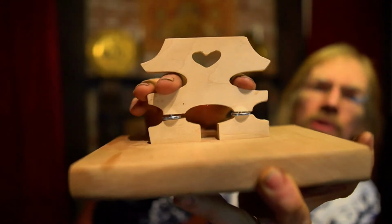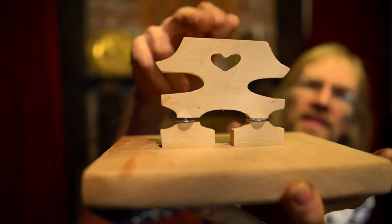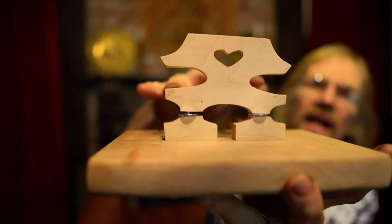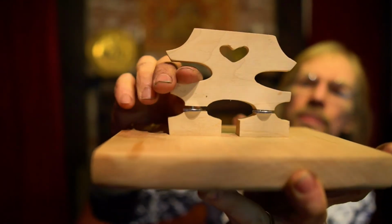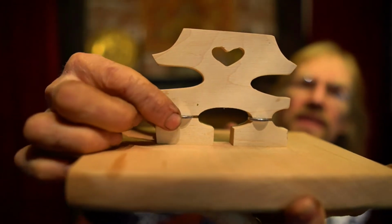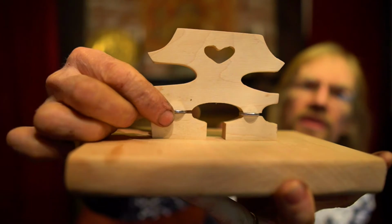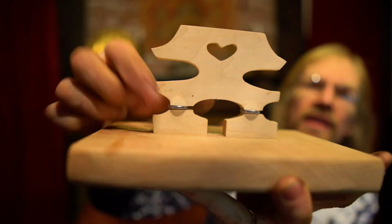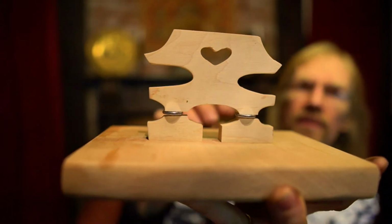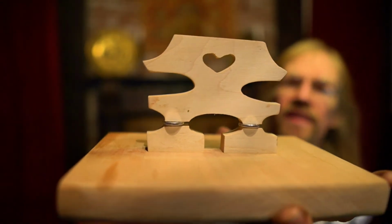Why do I mention that? Why is that important? Well, when you're adjusting the thumb wheels, keep in mind this top portion is resting on the mounting posts there. So you don't want it to get cockeyed sideways or else it could jam up and stop raising or lowering, which is kind of a hassle to sort out. When you're raising it, turn one thumb wheel a couple of turns and then the other one a couple of turns. A couple of turns here, a couple turns there. So you're not lifting one side way up and the other hardly at all. You're keeping them kind of even as you work it upwards or downwards. That way it won't get jammed.